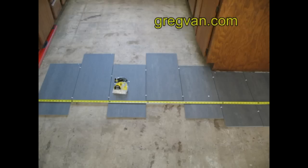Make sure that you take the time, however long it takes. I don't care if it takes you eight hours to lay out the tile and put it in different positions. The job's going to go a little faster, you're going to be making fewer cuts, you're going to have less waste most of the time, and you're going to end up with a better product.